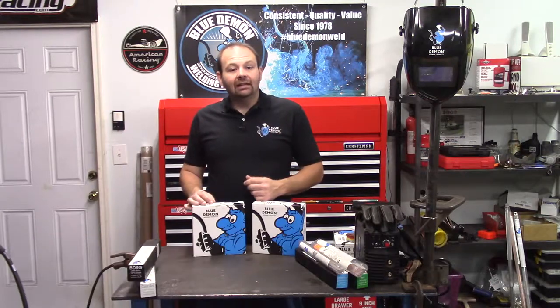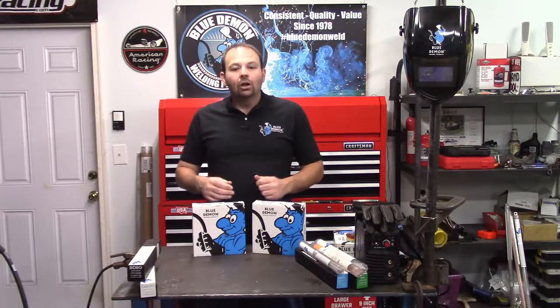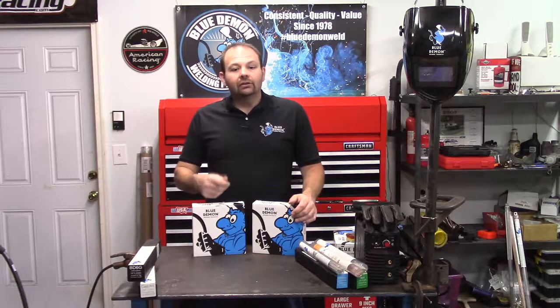Hard-facing filler metals are divided into three general groups. They are resistance to severe abrasion, resistance to both impact and moderate abrasion, and resistance to severe impact and moderately severe abrasion. Blue Demon's 58 FC-G is a great choice for environments with severe abrasion, moderate impact, and metal-to-metal wear. This filler is metal cored and a very economical hard-facing alloy. Blue Demon's 55 FC-O has a good resistance to abrasion, impact, and excellent resistance to metal-to-metal wear.